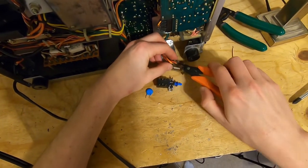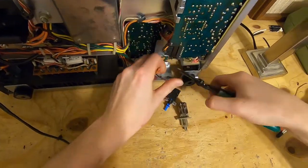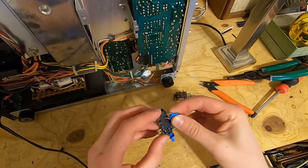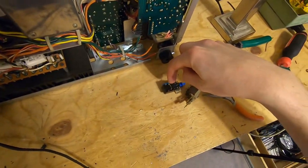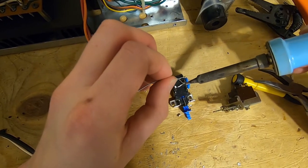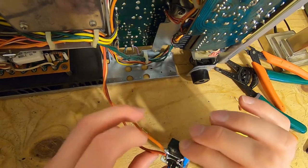Let's start replacing this switch now. Red in front, original in back — let's remember that. We'll cut these as close as we can to the wire because we're going to strip them so we have as much wire as possible. After you've stripped your wires, if you're not adding a snubber capacitor, just solder your wires to the new switch just like they were on the old switch and you're basically good to go. If you are adding a snubber capacitor, hopefully it has longer leads — if so, you should be okay creating a bridge between the two sets of poles. If it doesn't have long leads, you'll need to find some wire — solid conductor wire is helpful, or dead components with leads. Soldering it together is pretty simple; just make sure your solder flows nicely around the entire terminal.